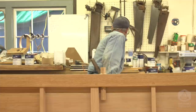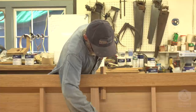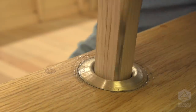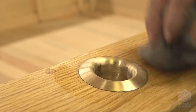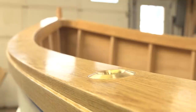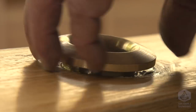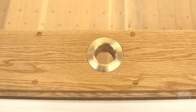Now all I have to do is drive the arbor out of there. I'm using a little acid brush just to clean up some of that excess epoxy around the hole, then I'll take a rag with some alcohol and finish cleaning it up. We're getting a good look at it and it's pretty much exactly what I imagined — it's worked out really well, made from a through-hull fitting. I've imagined doing this for years. I like it because it doesn't have any screws holding it down, the thing is not going to come loose — it's got that monster nut underneath it — and it is removable. It makes you wonder what's holding it in there, but something's definitely holding it in there.